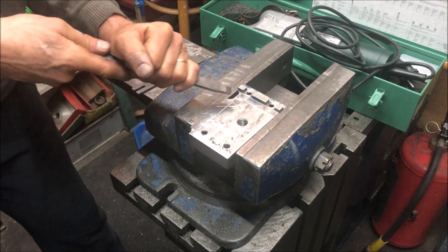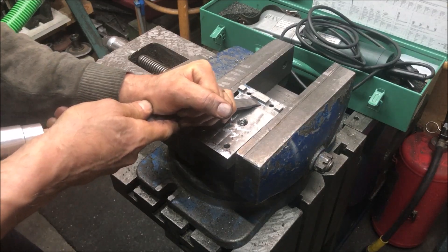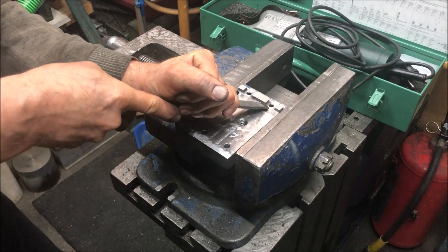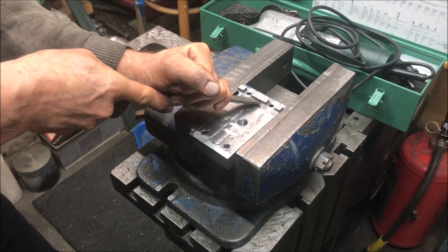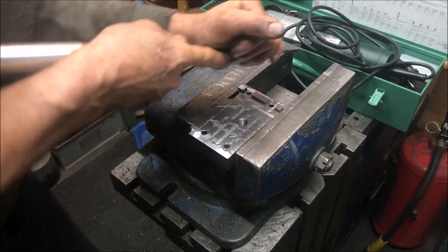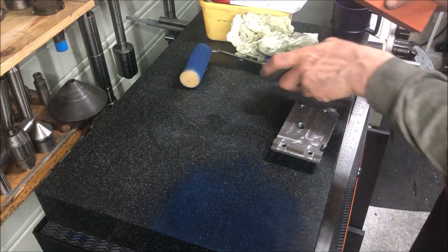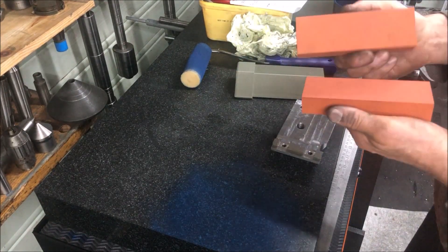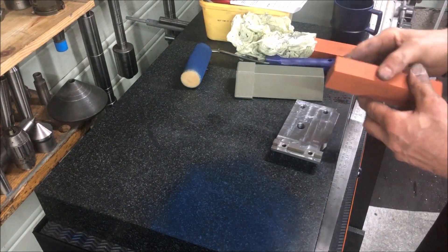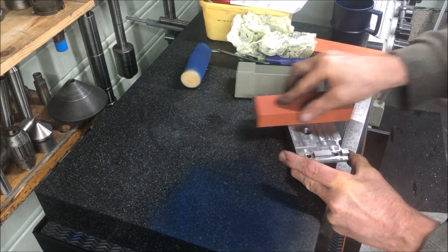Just working where it is — I can relieve this inner area here as well. It just came to me: of course I could use the precision ground stones that I bought from a scraping friend. These are actually flat — very flat — so those could also be employed to flatten the surface here.